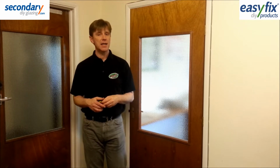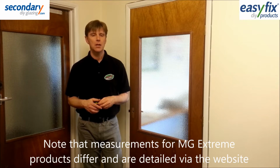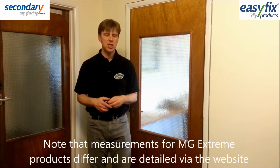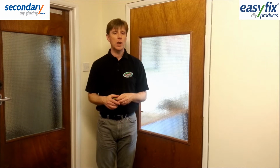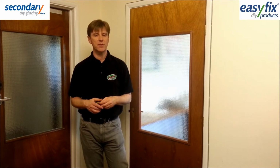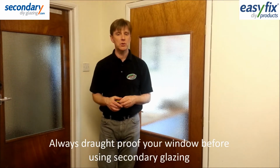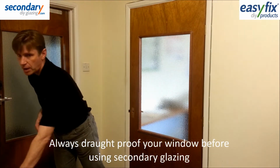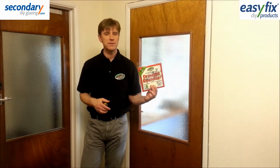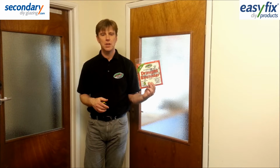Add up the lengths of Magnetglaze required for all sides of all glazing sheets. We're using 2mm plastic sheet in this demonstration, which works well with this product, but 3 or 4mm sheet might be more suitable for larger windows. Make sure you draft proof your window before starting, using Easyfix DIY draft excluders such as DE901 foam strip. Details of these are also on our websites.